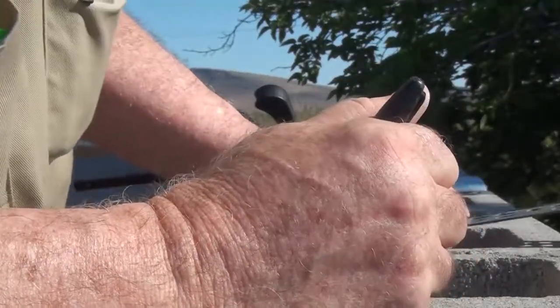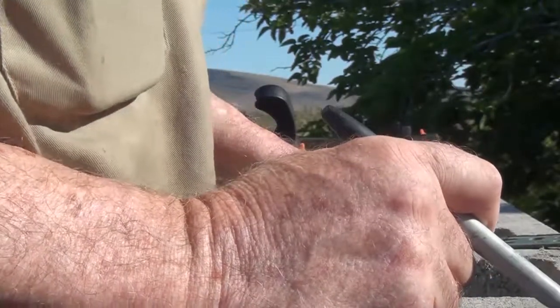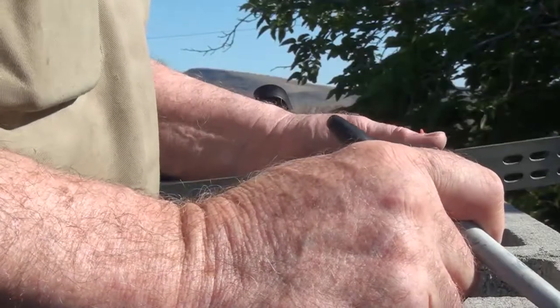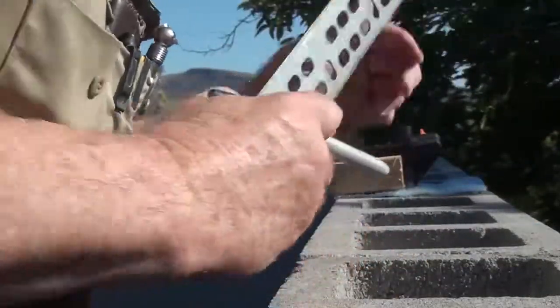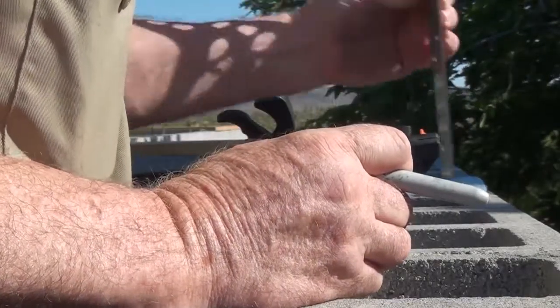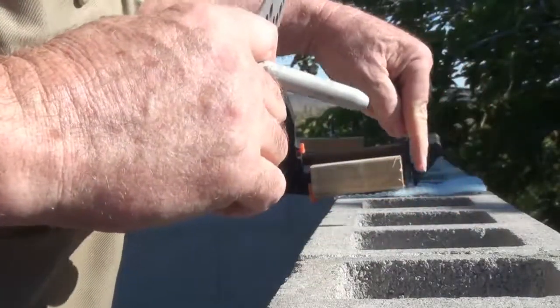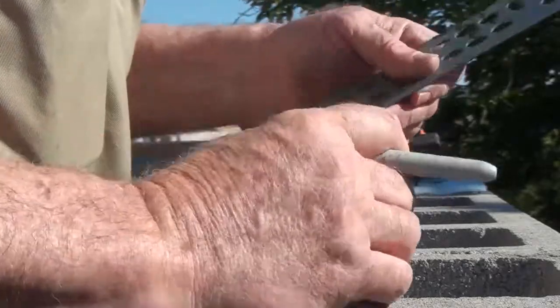Then I take the board off and I drill a 3/4 inch hole. It's a little larger than this 1/2 inch bolt, but what it does is it gives me a little leeway this way and that way in case I don't quite line up, because these bolts are not quite exactly straight up and down a little bit, and they're not all in a line. Some are here, some are here. They're not off that much, but they're off maybe just a little bit.